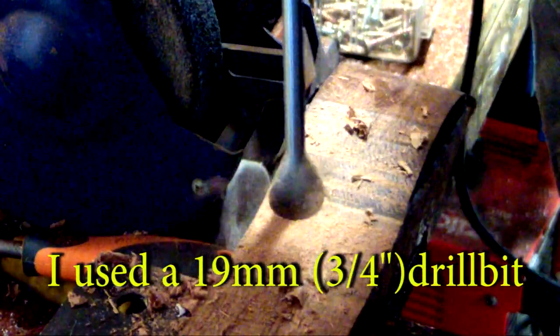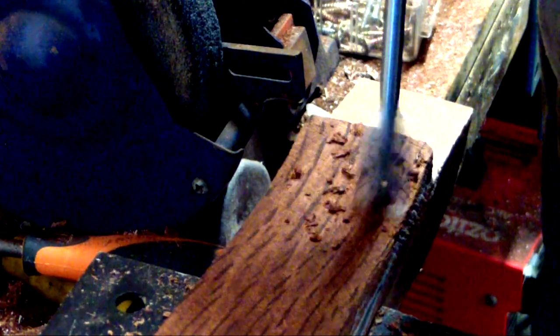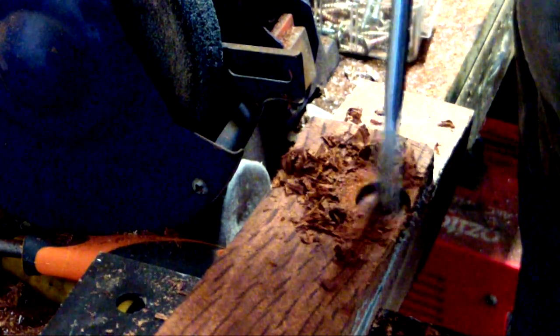However, if you are going to use the drill bit to get a radius, you need to drill in from both sides, otherwise it will mess up the wood as the drill exits the timber.